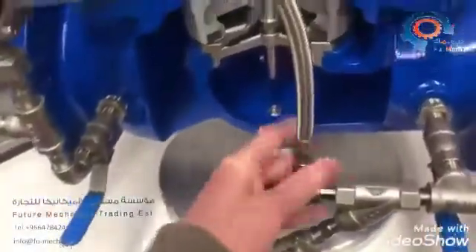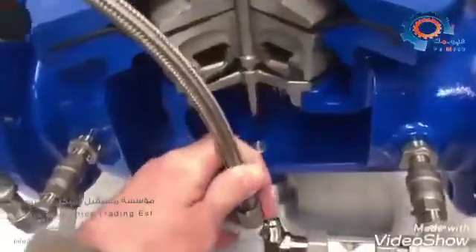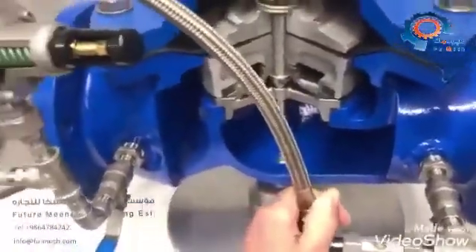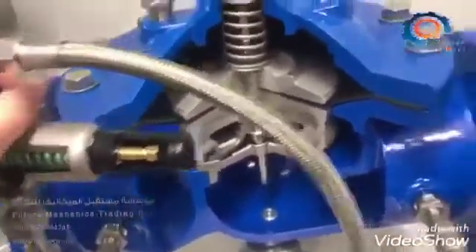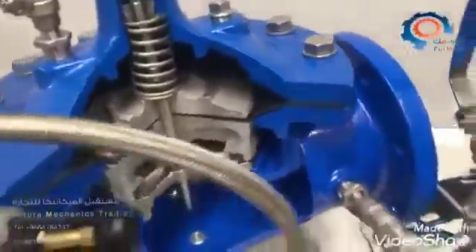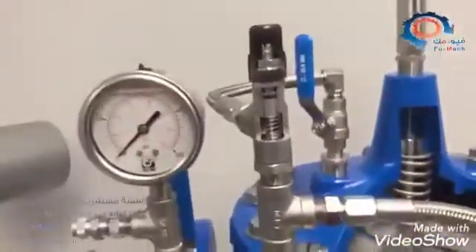Next we have a flexible braided hose. When you're doing troubleshooting, it's nice to be able to remove and replace the tubing to verify what flow path you're getting — are you able to get water to the bonnet and out of the bonnet? A flexible braided hose makes that a lot easier to do. Then you have your opening speed control going into your bonnet.